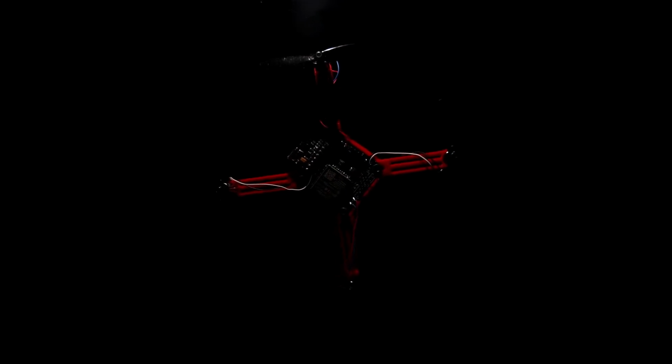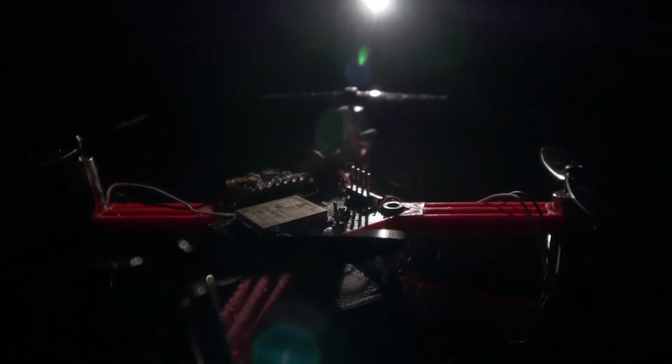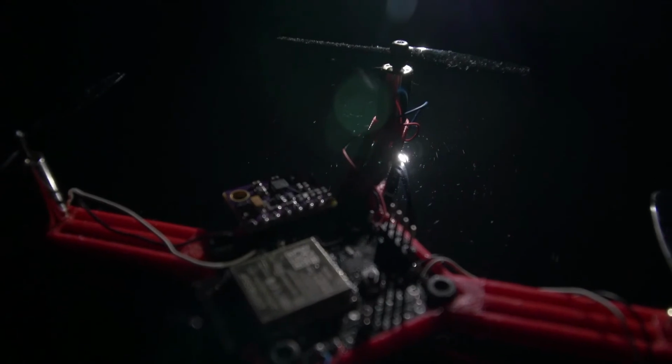Over the course of a few weeks, after designing the flight controller and frame from scratch, we assembled the final product together. The final prototype, Project Mikro V1.1, features an 800 mAh battery, a 3D printed frame, 4 8520 motors, and 65mm props, and a custom ESP32 based flight controller with wireless telemetry. The total cost of an entire drone, from motors to batteries to sensors to board, is $41.19, proving the viability of a low-cost experimentation platform for open-source autopilots.